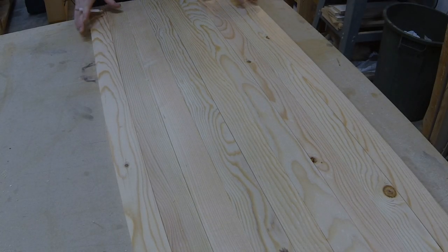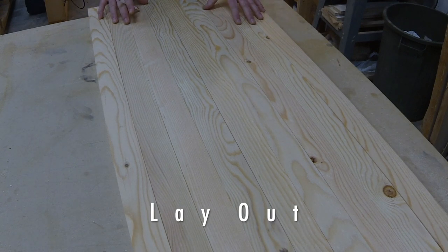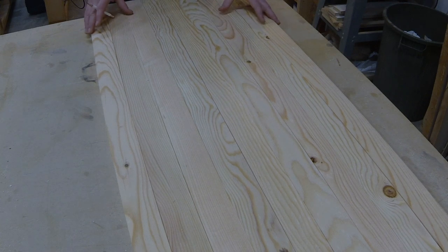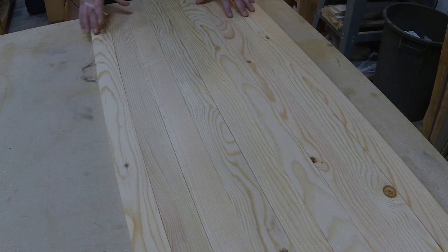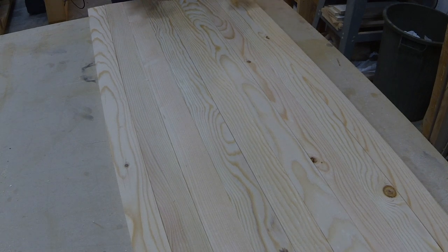At this point I've processed the wood to a rough dimension. What I like to do is lay it out and take my better pieces. You always want to over-cut and make additional pieces because you're going to have pieces that fail. I've laid this out over length. When you cut your width you can cut it to exact dimension or trim it at the end. Right now I'm getting ready for glue-up, so I just number my pieces.